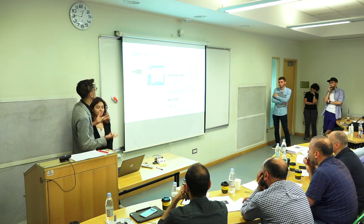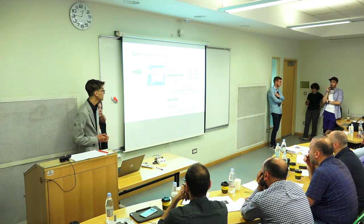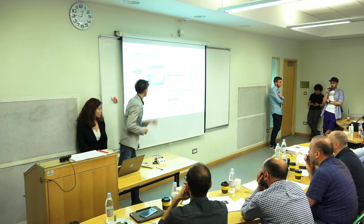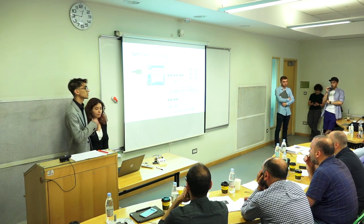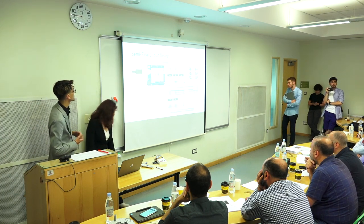Here's the semi-final circuit design. It's not the final design because we also added an SD card adapter to the Arduino. But you can see that there are two buttons over here, which will be the user input. One of them will change the page to the next word, and the other one will do the opposite, going to the previous page.